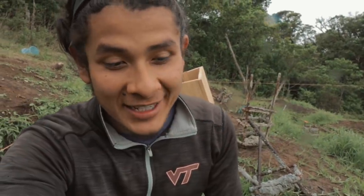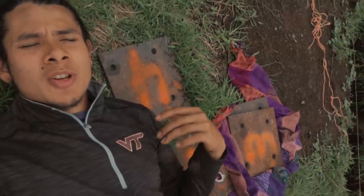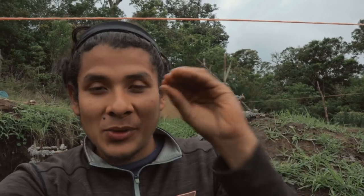I just discovered something new to me, and I'm glad I asked because otherwise I would have been screwed. I texted the architect who designed my house — he knows about building with concrete — and was asking him about how to weld the metal plates. He asked me how I was planning to bond the old concrete with the new concrete. I said I was just going to pour the concrete right on top, and apparently that's not the right way. He recommended I buy this thing — a concrete bonding agent. It's basically a kind of paint that makes it easier to bond old concrete to new concrete. This is what happens when you don't have much experience working with concrete.